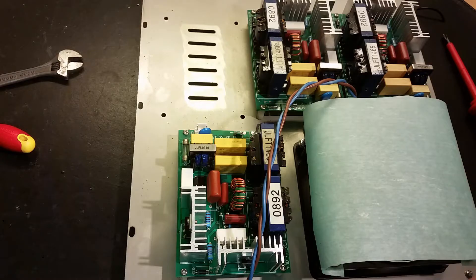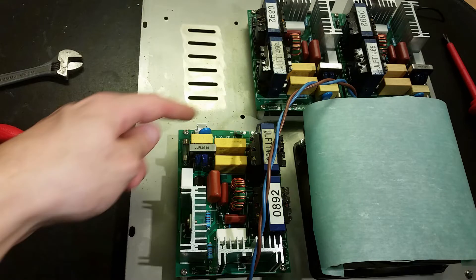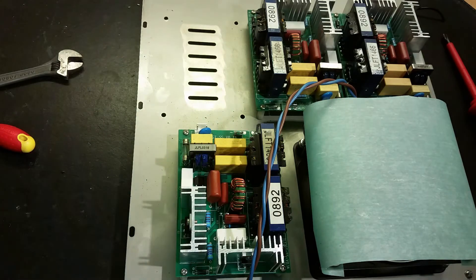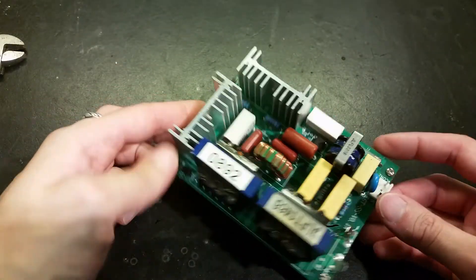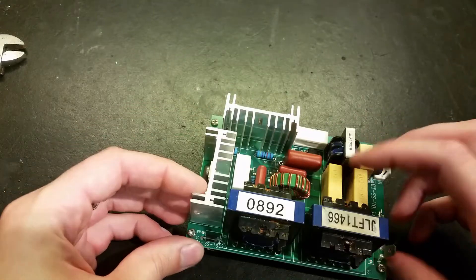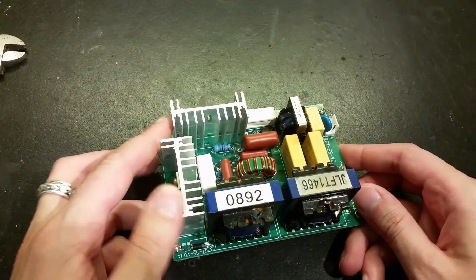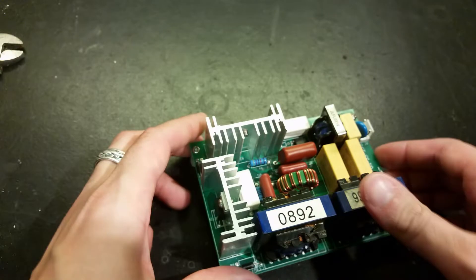I think we can actually get the same ultrasonic cleaner in a more powerful version which has a fourth board. So I'm going to remove this board and put it away from the drain tube, just in case it leaks. Here's the circuit board — there are only two transistors, a gate driver, a transformer, an inductor, and a rectifying diode. The transducer is connected to those two outputs. It should be a Royer oscillator. It would be nice to reverse engineer one of these circuit boards, but maybe not in this video. That's quite a neat little circuit.